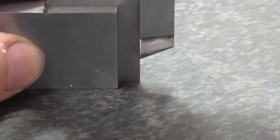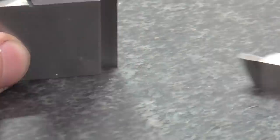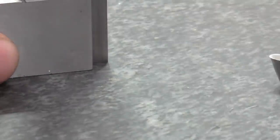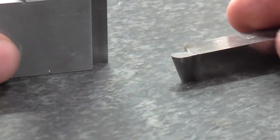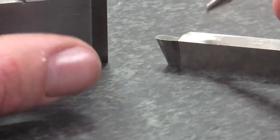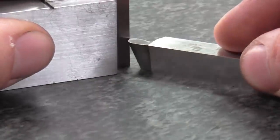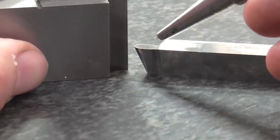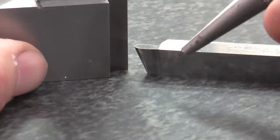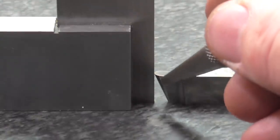If we have a look at the top rake you can see the surface also slopes backwards. This sloping backwards of the tool is known as positive rake. You do get negative rake and you'll typically find it on carbide insert tooling where the cutting edge is actually sloping upwards — that's negative rake and a topic for another day. But for simple form tool grinding or traditional high speed steel tool grinding you'll see positive rake — the cutting edge and everything sloping backwards. If you're ever having trouble with tools not cutting, that would be my first port of call: consider the cutting edge and consider whether it is sloping backwards everywhere. An example of where you might see negative rake on a high speed steel tool in a model engineering workshop is for materials like brass — it can be a bit grabby and some people advocate the use of a negative rake to get around that.